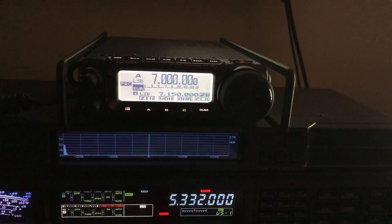For example, we can't exceed our bandwidth, and that presents a little bit of a problem when it comes to using sideband, because the 60 meter band is channelized. The channel happens to be the center of a 2.8 kHz bandwidth. For CW that's fine, but for voice at 2.8 kHz wide bandwidth, if you were transmitting upper sideband from the center of the channel, you would exceed the bandwidth as you move up. Once you go up 1.4 kHz, you're outside of the band. There's some trickery that we do, and the manufacturers program it into the radio for us.